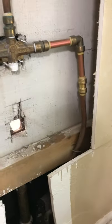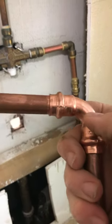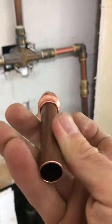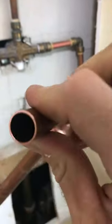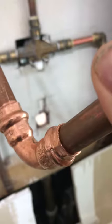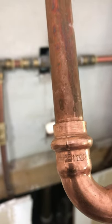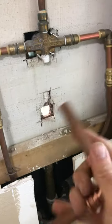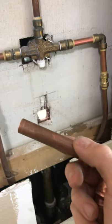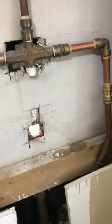I've already made my new tub spout with rigid ProPress connections. You can see they create a six-sided hexagram type shape when it presses, and it leaves a little signature pattern from the press, but they're very solid. It's either this or you do the soldering inside the wall, but this is really nice to use — it's quick.